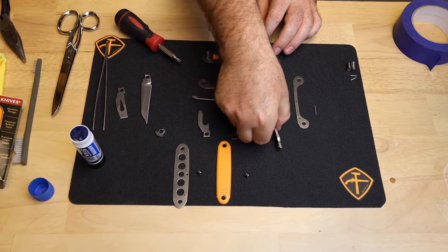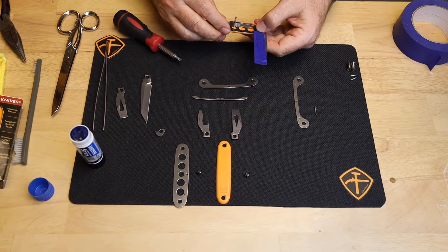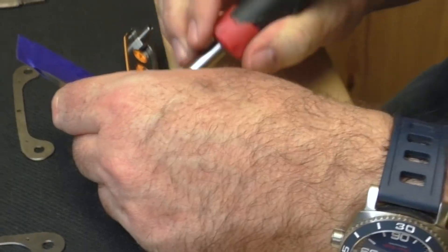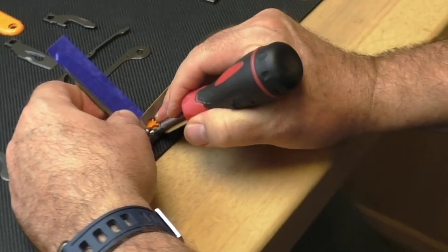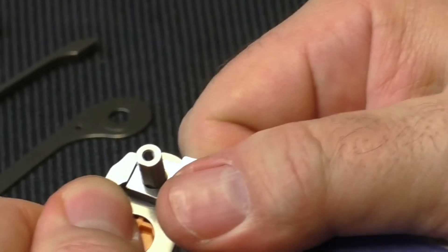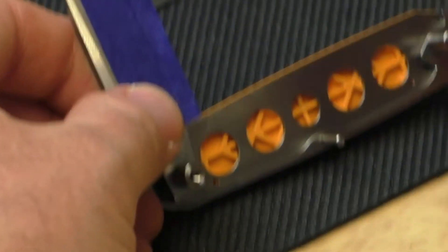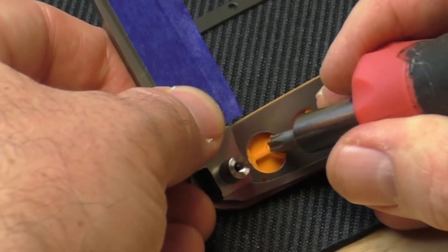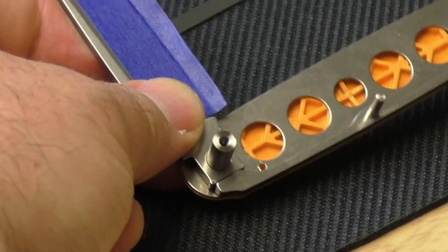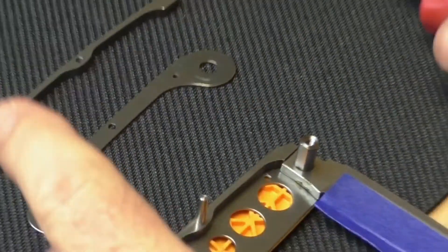Next we're going to put the blade in. Take your blade with the tape on it. Hold it like so and put the knife on. I flip it around so I point the blade away from me, point it up at a 45-degree angle. I can take my driver tool, set it here on top of this spring, and pull down until that drops in place. I'm going to show you that one more time since that's the thing on this whole process that's going to cause you grief. Just set it right here — not in the hole, don't jam it against the plastic — just push down on the spring until it opens and you drop your part in. Once your part's laying in flat, I like the opening of the knife and tools towards me when I'm working on them.